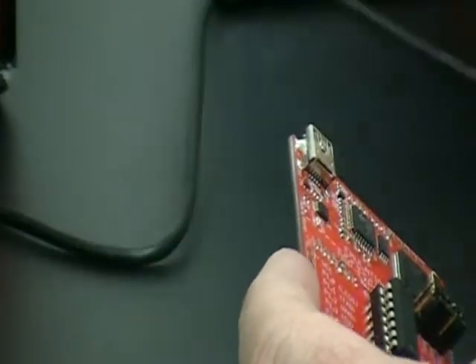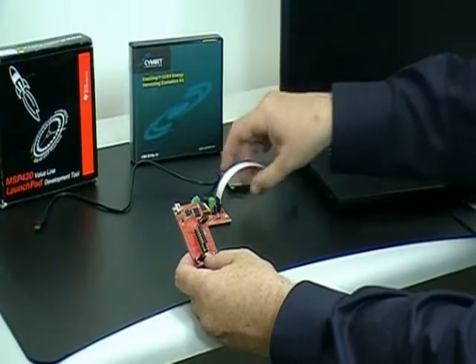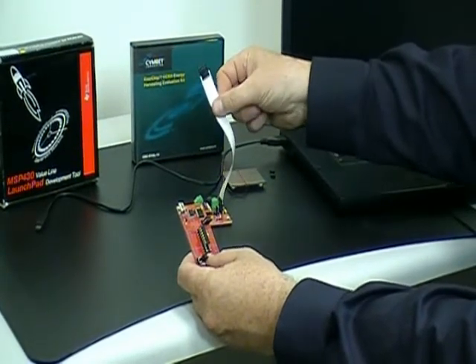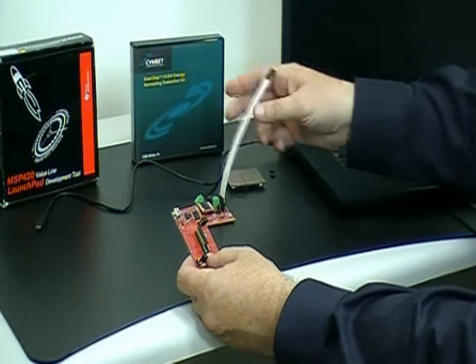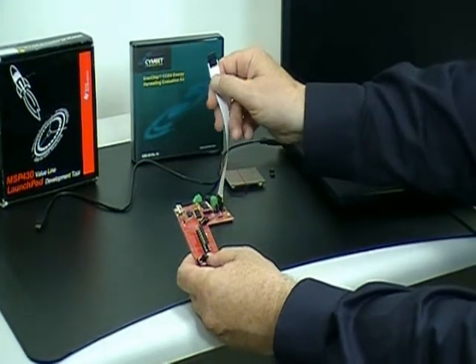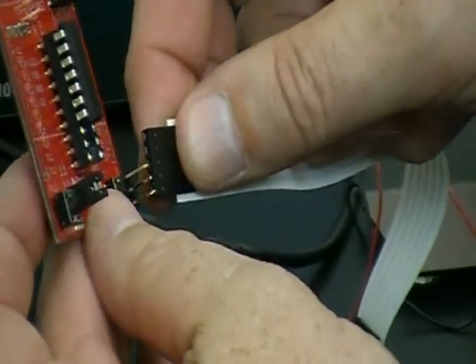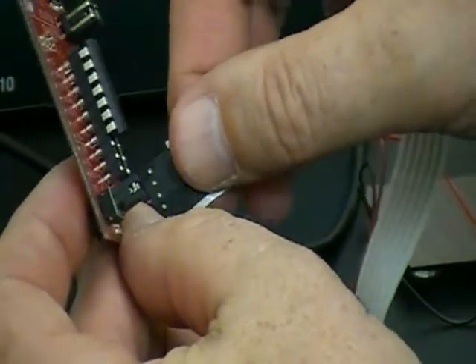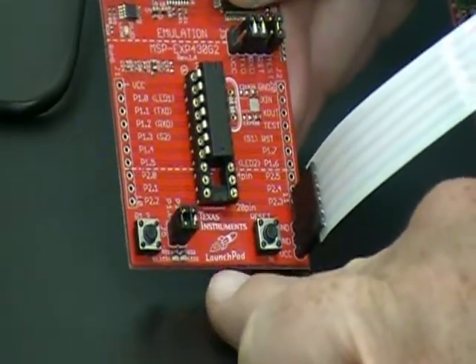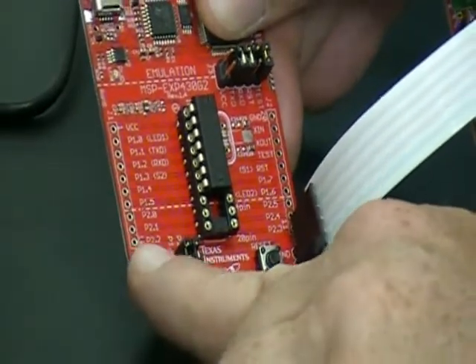After you've installed your solar cell to the EVAL 10 board and the accompanying flat flex connector with VCC on pin 5 to the gray conductor, we bring that around and plug it into the three-terminal connector with VCC and ground pins aligned and two pins hanging off the end. You can see the application is running — the lights are blinking indicating it's in ready-to-go mode — and we're going to start logging temperature data by pressing this button.